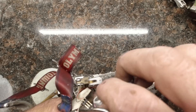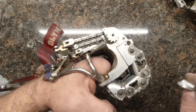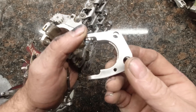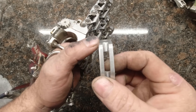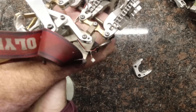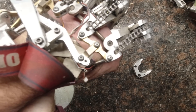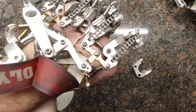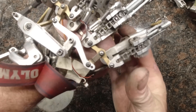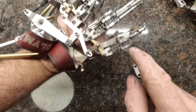I also want to move the point of rotation of the MPJ. The current design has the base of the finger being composed of three pieces. The new one is made of one and will shorten the overall length of the finger by almost half an inch. This should also help with grip strength by shortening the overall length of the finger assembly. Another change related to the MPJ is putting all of the motion components in a linear rail, so I can get rid of the bend that the chain picks up when the fingers are closed and splayed. There's nothing really wrong with it functionally — everything moves smoothly and returns to home just fine — I just don't like it from an engineering point of view, so enclosing everything in a rail should fix that.